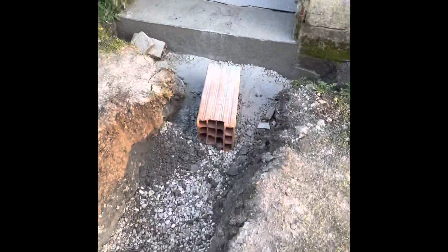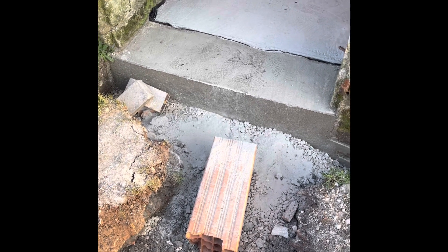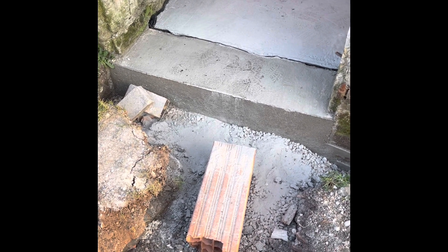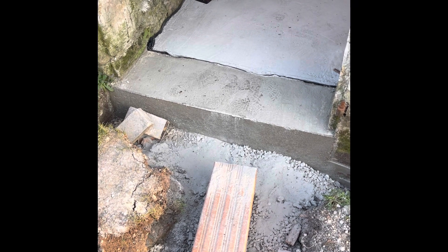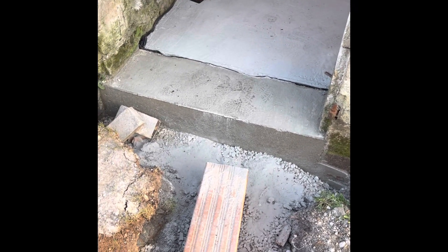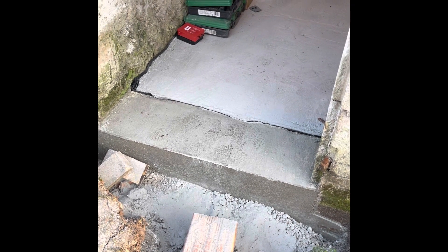Back outside, the trench goes into the barn. We had to dig out this room — it was just sand on top that someone had sprinkled in from the river, then underneath was clay, and underneath the clay was water, so it was proper heavy going. All dug by hand, then hardcore, then compactable calcare — a compactable limestone and sand — and then on top, 120 millimeters of reinforced concrete with a DPC. It's not a habitable building, but it was important to have a dry slab.